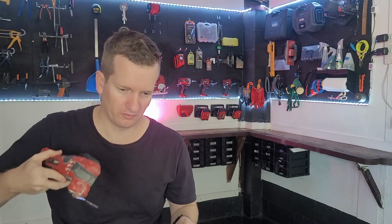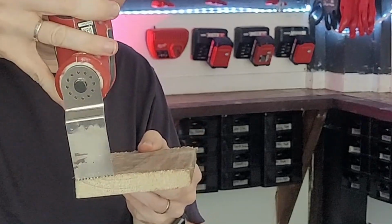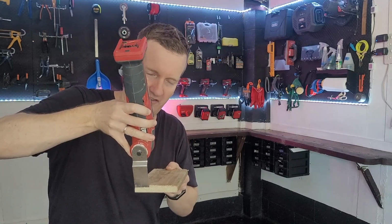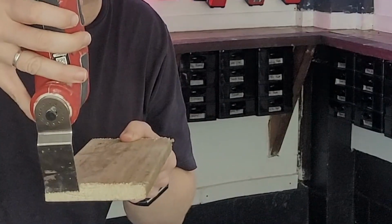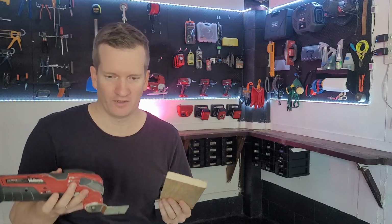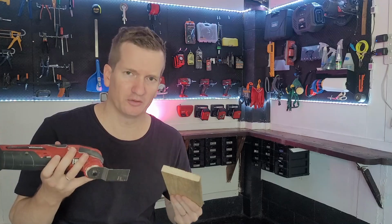Outside of considering stability, what is the optimal way for both the protection of the blades and for the efficiency of the cut? So let's just say that I'm demonstrating this in the cut. If you're cutting like this, it's not really much of an area where the cut up bits of wood can go to, and so then it stays in the area where you're cutting and then provides you further resistance and also slows down your cut. Furthermore, it'll build up a bit of heat friction, and over time that'll dull your blade, and also it'll be very hard elbow work.